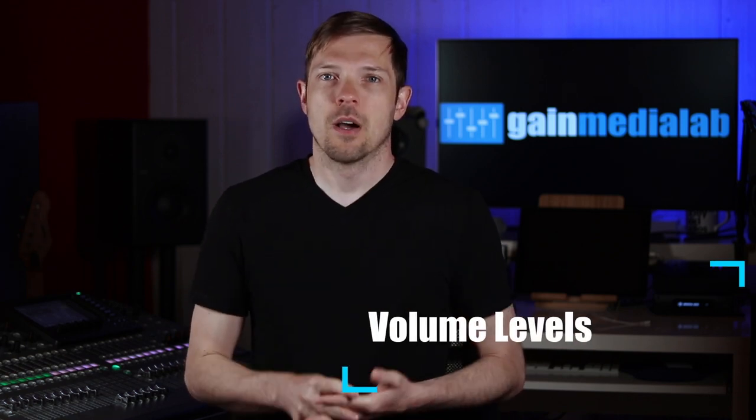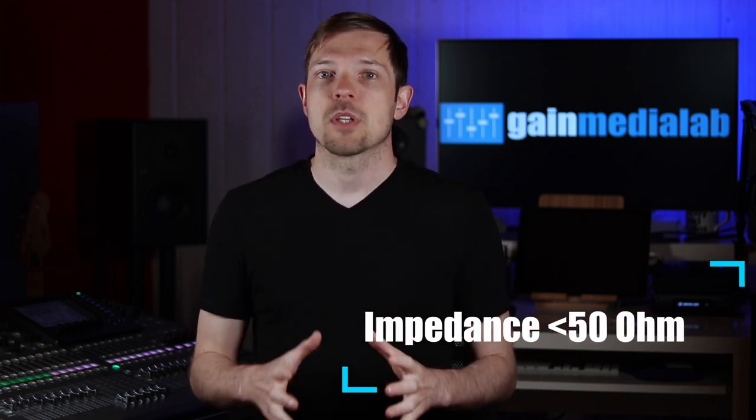Let's consider levels. Even if the headphones provide the best isolation possible, using them in extremely loud environments will mean that they have to be quite loud, even when driven by headphone preamps built into consoles. Those preamps can be quite basic due to spatial restrictions and are not equipped to offer a lot of juice to run headphones with high impedance values at a level that can overcome the ambient noise of a loud show. So the only choice is to use headphones with lower impedance. With that, we usually sacrifice a bit of detail; however, it would get drowned out by the potentially loud environment anyway. Aiming at values up to 50 ohms should keep you in a safe region of models that can be used on just about any mixing board in live sound environments.